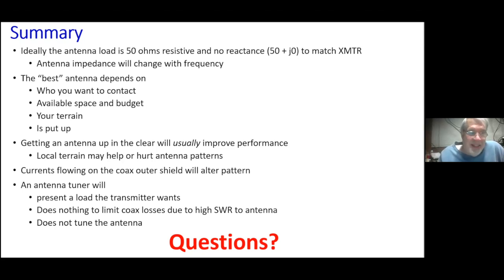Well, you know, the 300 ohm twin lead line would kind of match close to that free space impedance more than the 50. Maybe the problem is transmitters want to see a lower impedance. I don't know. No, you can design them. You can design them. And 50 ohms is kind of a compromise impedance.